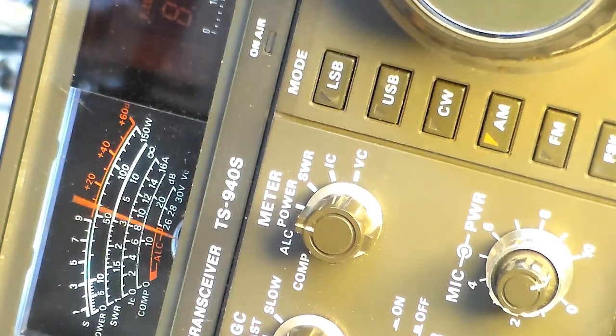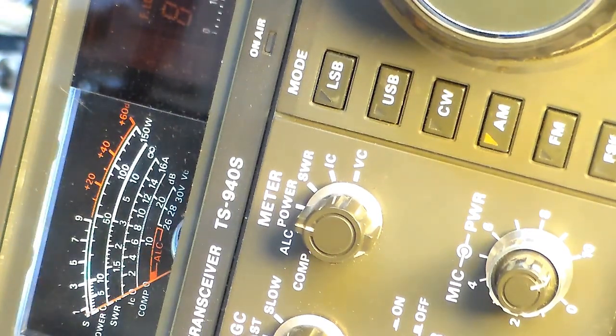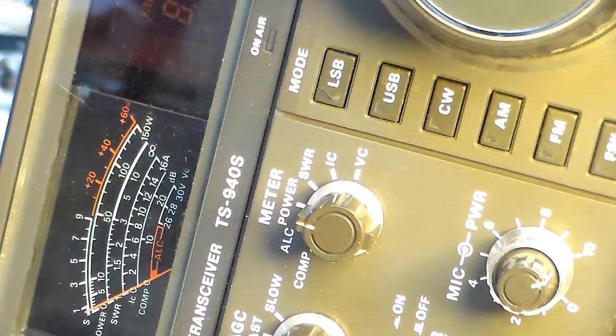Now watch when I turn it off. No bump turning it off. Little bump turning it on, not very bad, doesn't go anywhere. Turn it back off, no bump. So either I need a 200 microfarad capacitor there as opposed to a 100, or I have a bad new capacitor, which I doubt, or I may have put it in incorrectly.